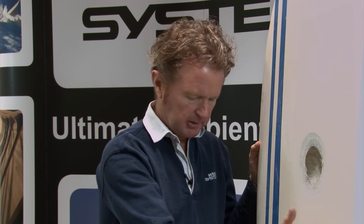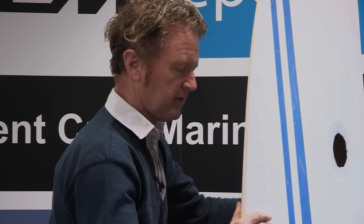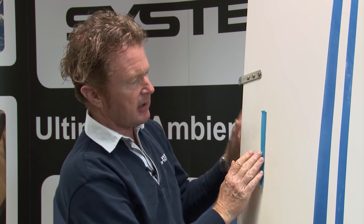Next step - we're going to make what we call a backing plate. It's impossible to laminate against the hole, so we need something to support our laminate as we build up to the existing laminate thickness. To do that, we're going to put some release agent on a small part of the boat and create this backing plate using a single layer of glass fabric with peel ply on the back. This topsides repair is in an area where there's not too much shape, so quite conveniently I can do this on the other side of the hole where the shape is nice and symmetrical. We actually call this type of repair a letterbox repair.